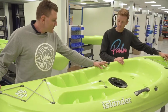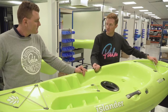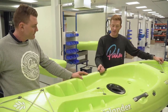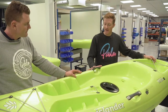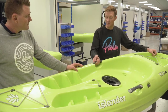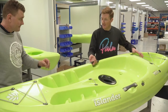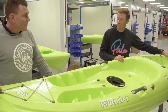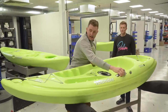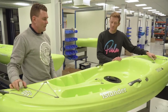We looked at what's simple, what can be multi-use fittings, and how they fit with our newest aesthetic. The handles are injection molded — highly durable, tested with FEA model analysis. Compare that to a molded-in handle or a webbing rope: the injection molded handles give us an aesthetic point, we can bring styling elements and our own branding into them. We've designed these to be extremely ergonomically comfortable from different angles — whether used as a side suitcase handle or stern handle — with soft corners and soft edges, usable by different hand sizes.